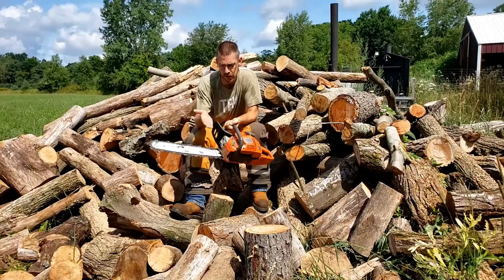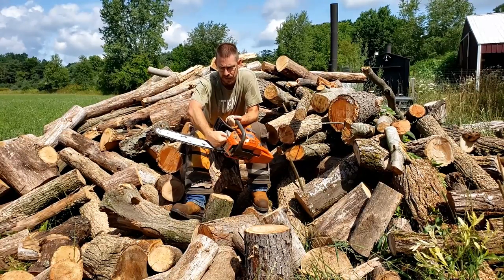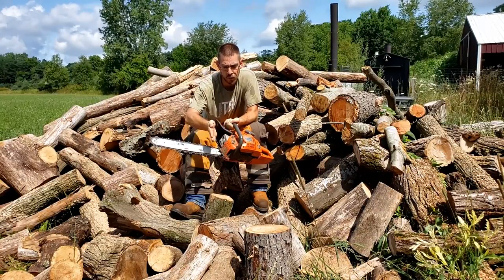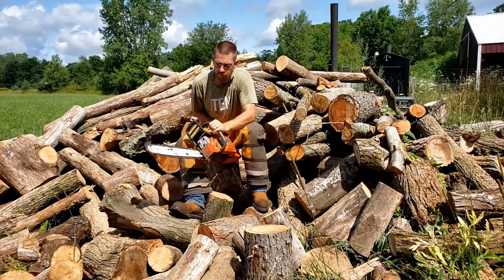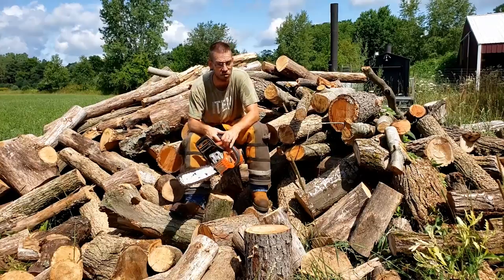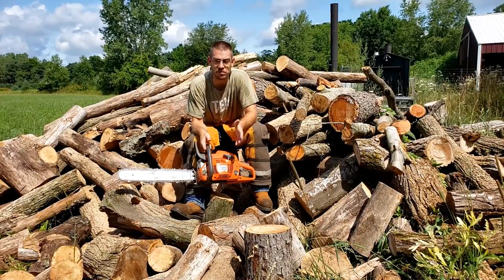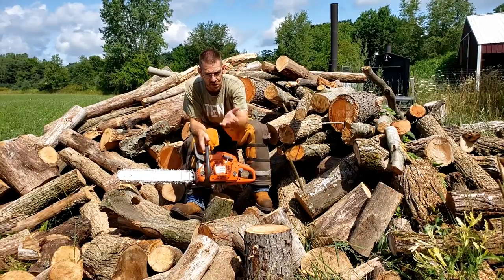When I'm cutting logs on the ground, I use these spikes, and generally what I'll do is I'll lock that right up against it, and I'll feather that cut through. So I'll continue to get that fork and use the leverage of the saw back here to pull that chain through as much as the engine can handle. I go full throttle, and I give it as much as the saw can handle, as much as the engine will take. I'll keep feathering it through there until I get through the log.